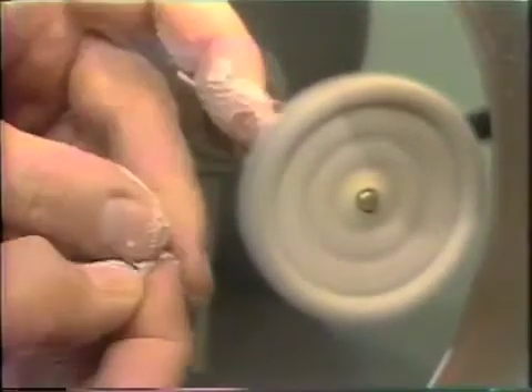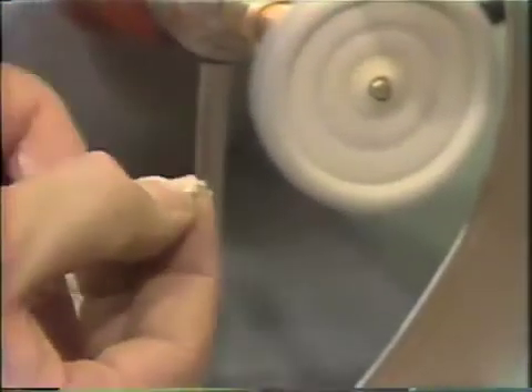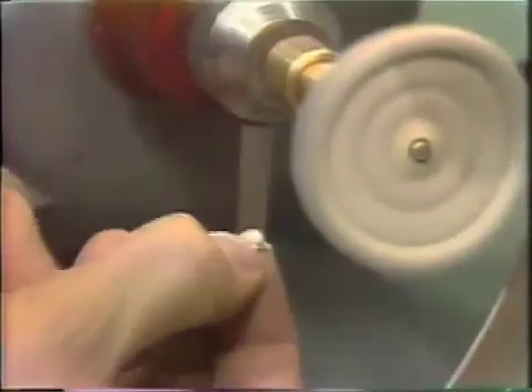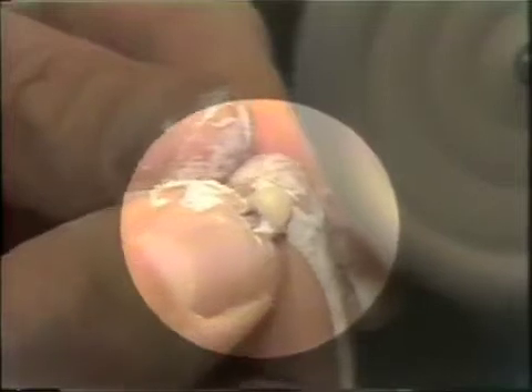Now, polishing this ridge area — the best way to do that is to take the pins and put them under your thumbnail, and that will give you a good grasp of this delicate pin facing. Place the Triple-X Silex on the saddle area and then bury that saddle area into the rag wheel. Notice I have the pins stuck under my fingernail — that gives you a good grasp. Then you add a little bit of abrasive material and either run it on the edge keeping it moving, or you can take the saddle area and push it in, separating the rag wheel and making almost a V, getting that under portion highly polished so there are no scratches or irregularities remaining.